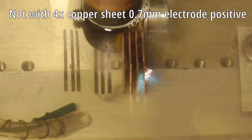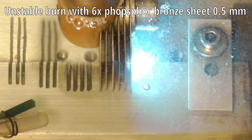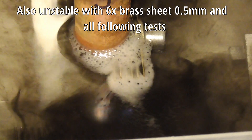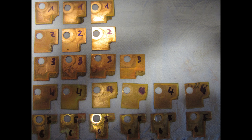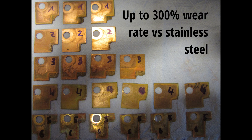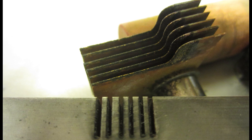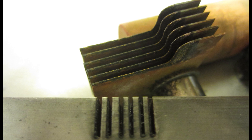For this I made many tests with different thin sheets of different materials and geometries, but never got a stable burn. On top of this, I have excessive wear on the electrode, which is sometimes more than 300% versus stainless steel. I am not sure if it is a problem of having too many electric arcs instead of sparks and how to deal with it. I know that a relatively simple resistor-capacitor technology results in more electrode wear, but this much would make it useless for me.